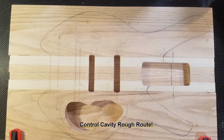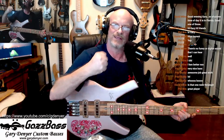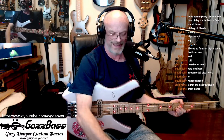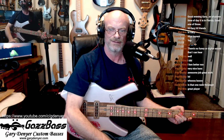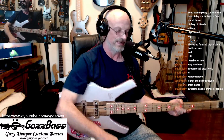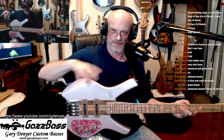And it's most important then to start routing out the channels before you even cut out the body. You cut out the body, then you've got angles all over the place that you can't get your router on. You might slip off and drill holes in your leg and stuff. It's not good for medical bill payments and stuff. So, you know, get the whole thing together.